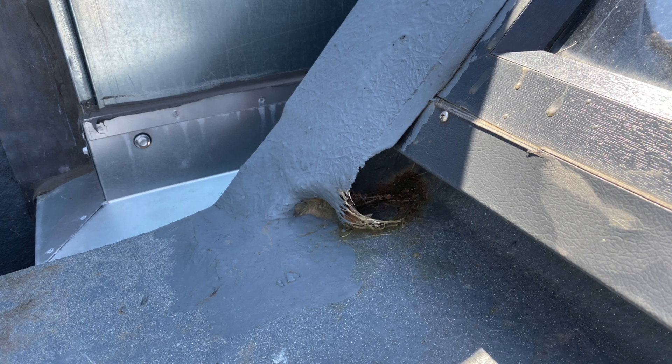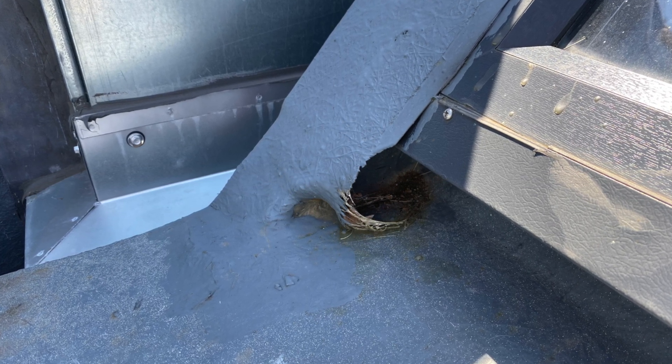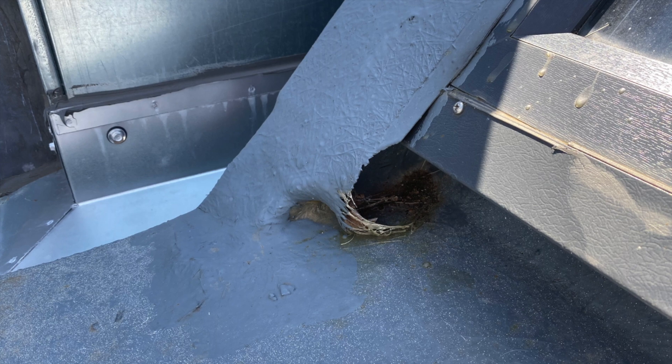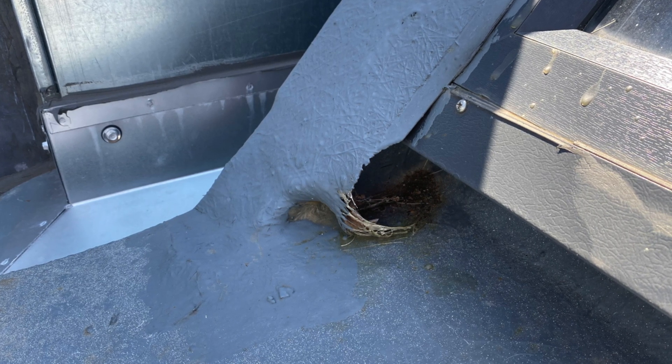A further example shows the absence of paddle roller coverage — the fibers are sticking up and protruding from the laminate, which should have been addressed before the top coat was applied. Another example shows an absence of a barrier between the edge trim of the window and the matting, with exposed fibers causing a leak in that area. Similarly, exposed fibers in another area represent a poorly done job — water can get in through the fibers into the laminate and cause a leak. All such issues should be tidied up using sandpaper and reapplied.